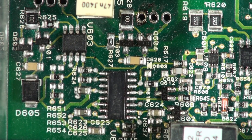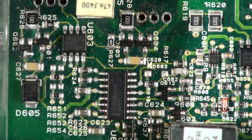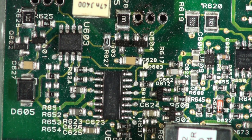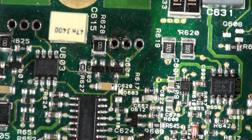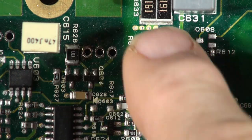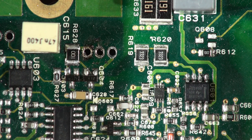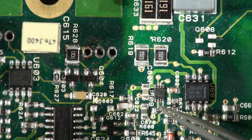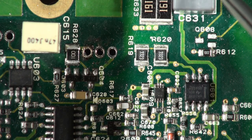After you've changed all those carefully with due diligence, if you power it up and it doesn't work, look over here. On the universal switching version of this, there are a couple of components. When the 15V rail gets dried up, this is a lockout circuit and a detector comparator which checks the input voltage coming in through the mains and then switches this relay.